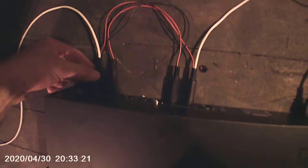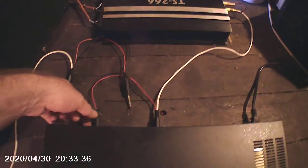Now part of that hum is the 50 Hertz hum, which I'll show you in a minute, but these are the inputs that come from the computer. Now pulling the inputs out, the white noise sound remains. Now with a very short cable between the EQ and the amp, we lose the white noise.